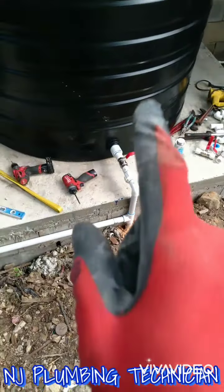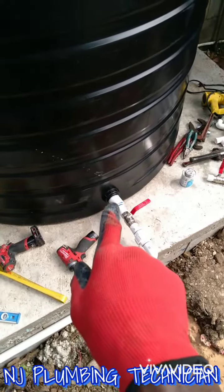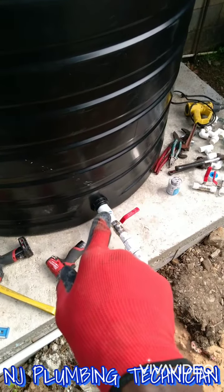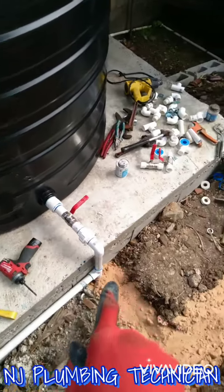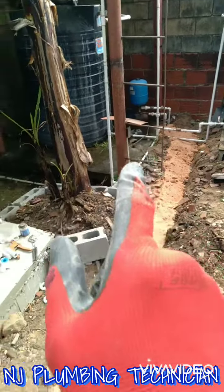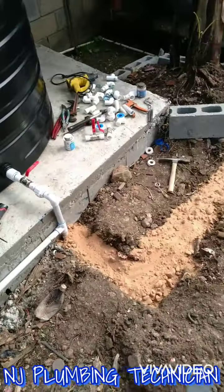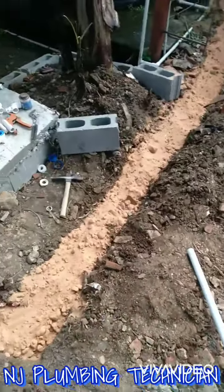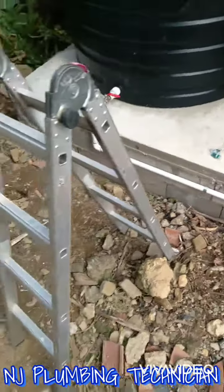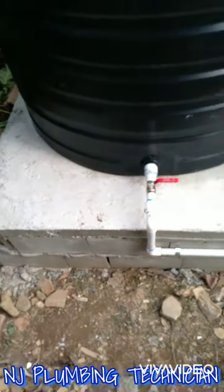It's a 1-inch pipe. It's a 1.5-inch bulkhead tank adapter, and we're pushing it down to 1 inch because the pump that is in the corner there is a 1-inch suction, so we don't want to reduce. We want the pump to flow free. We don't want it to stifle at all, so when he's sucking, he ain't stifling. So we're not running the pipe in 3/4.